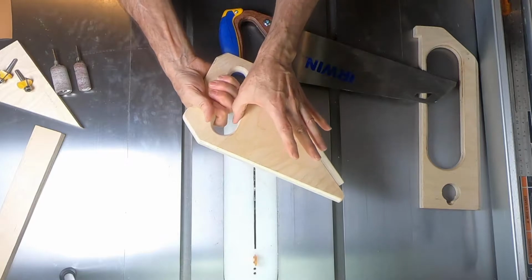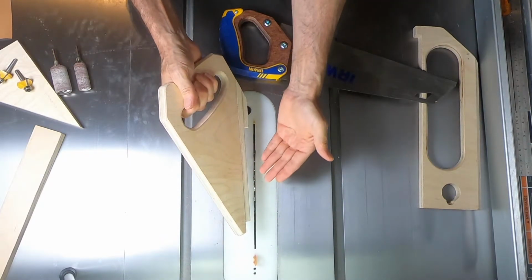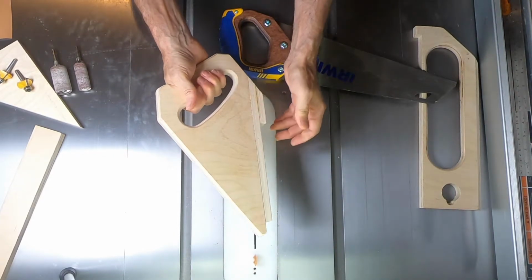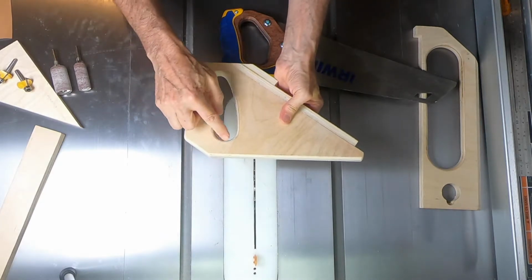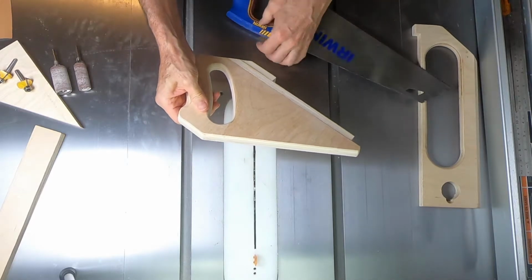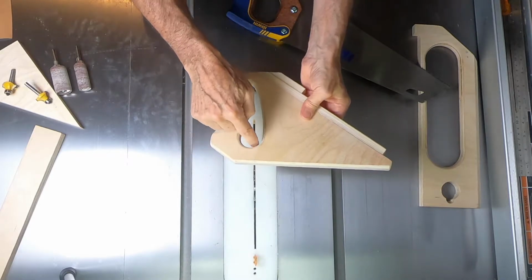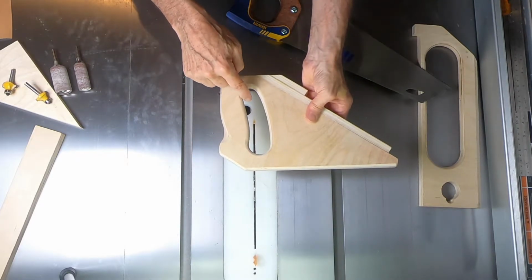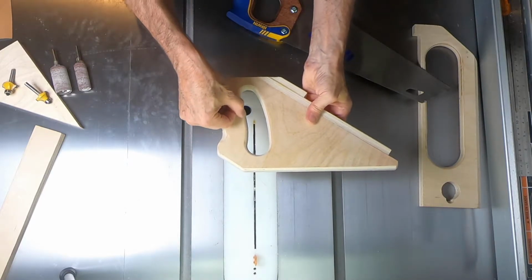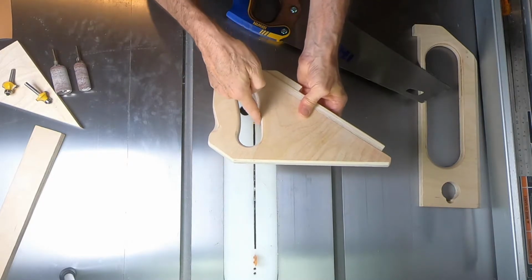And then I wanted to give a little extra room on the knuckles, just in case you've got a piece of material that knocks back a bit and you don't get too much impact here. So just to try to freehand a little bit, and I'll just walk you through it instead of show you because it's faster. So I took my piece of plywood and I cut out the basic shape. First I used a hole saw here, then I used a Forstner bit, and then I just freehanded a line